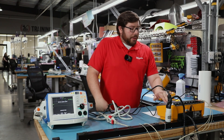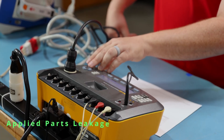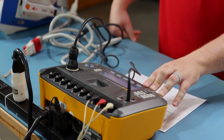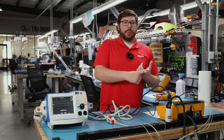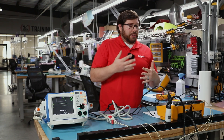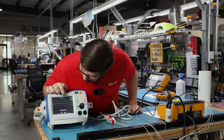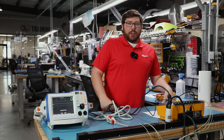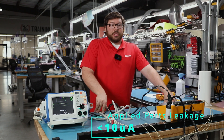One of the final tests on the R-series is applied part testing, which uses our three-lead selection. I'll select three leads and make sure I'm in normal conditions of operation — normal polarity, closed neutral, and closed earth — with the AC and DC circuits combined in their metrics. I can see a solid line on my ECG; I'm on limb lead one and have continuity. I'm measuring 0.2 micro-amps, which is passing. Normal condition states it should be less than 10 micro-amps. If I can see it below one micro-amp, I know it's an immediate pass, but for this demonstration I'll continue.